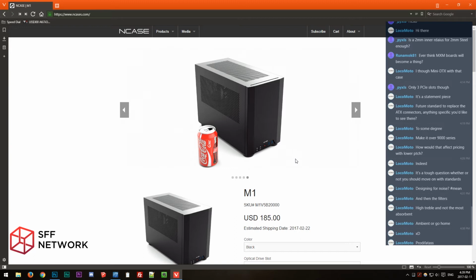So something like that, if you're running at stock, then unless you're really on the edge of power, so your power supply is barely enough, which I don't recommend anyway, then if the CPU is running at a slightly higher voltage, it's not really that big a deal. If the CPU is running on the hot side of things, personally I have absolutely no problem if the CPU runs at like 60, 70, even 80 degrees under load. Some people would recoil in horror at the idea of their CPU running at 80 degrees under load, constantly.